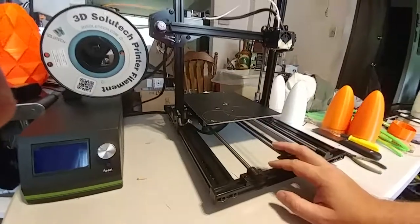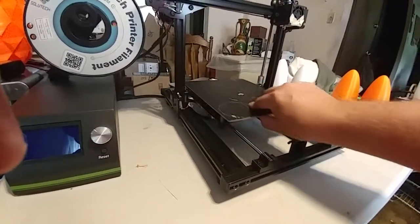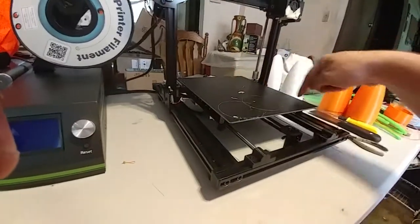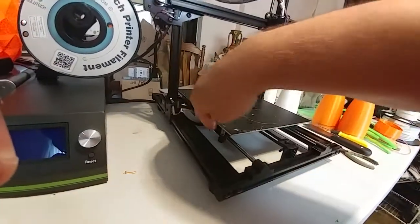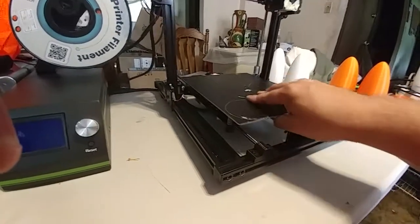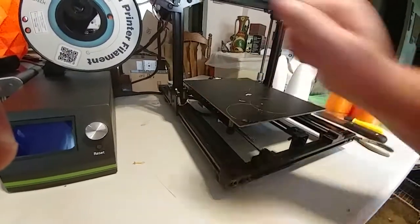Fix this crimp connector and extend these screws a little bit. If at all possible, get rid of this H-brace and go with a solid piece of metal — thick, like the Wanhao — with slight cutouts but all one solid piece. The H-brace is just a bad idea because these create lever arms that are easily bent, and so far pretty much every one of them has come bent, which creates a problem.